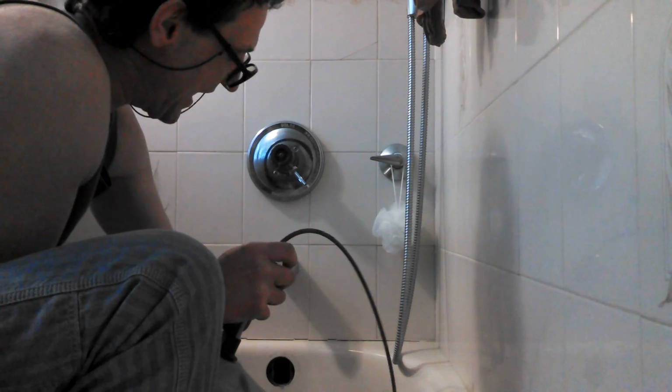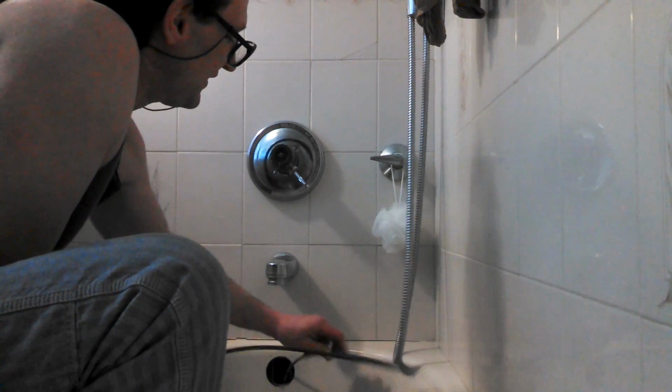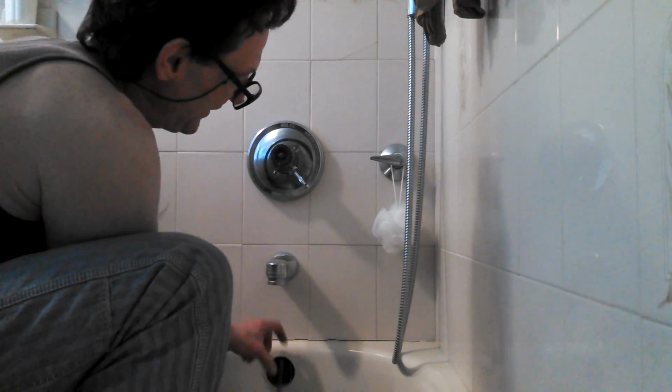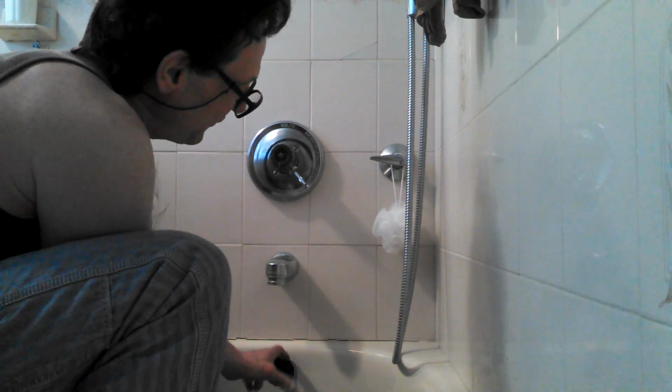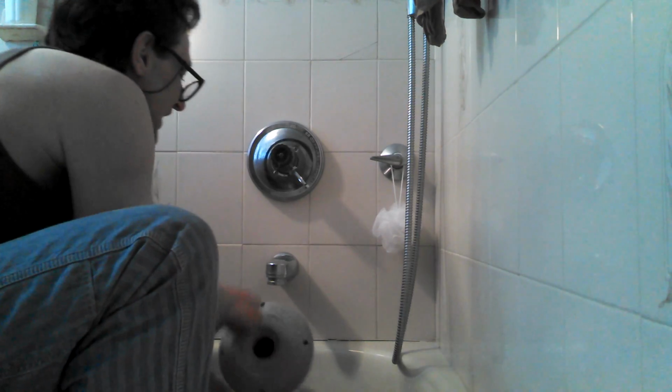Well, actually, we were about 3 feet in, which means I was probably down into the trap, and this came up with just a little bit of schmutz on it. Let's see if we can go one more time and go a little bit further. We have to reset this snake. The trick with these snakes is you don't want a lot of free stuff sticking out here. You want as short as possible, and then let it feed itself in as you're turning it. That's the trick to the snake.